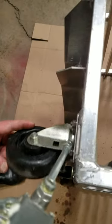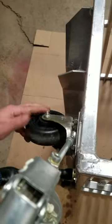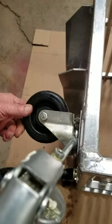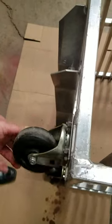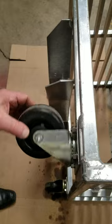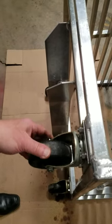If you work the swivel around as I'm doing here, the grease will get through the upper race and then work down into the lower race, and your caster will be greased for use in a freezer environment, say 0 to 5 below Fahrenheit.